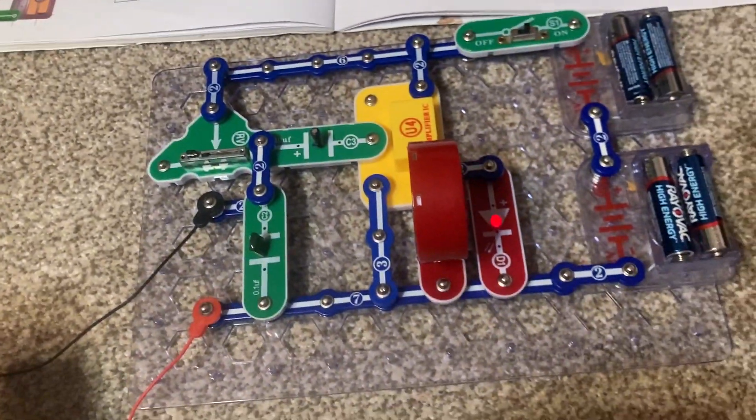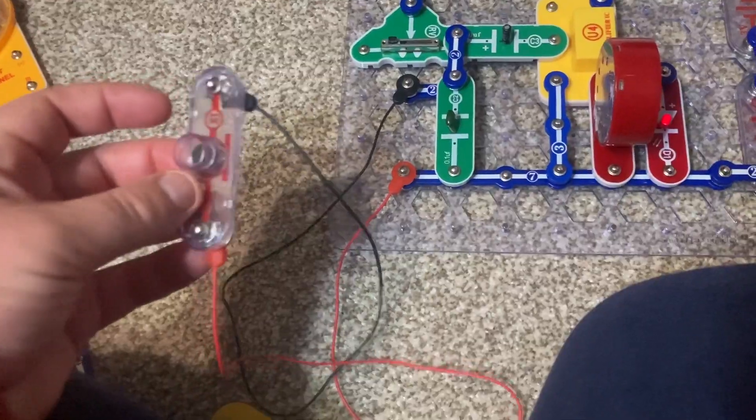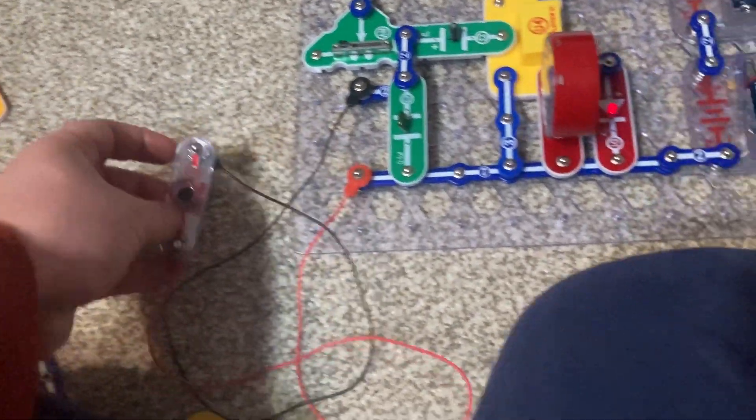With the adjustable resistor set to the far left, I turn on the slide switch and tap the whistle chip — you hear interesting sounds as the red LED comes on. The whistle chip has a piezo crystal between two metal plates; sound causes the plates to vibrate and produce a small voltage, which is amplified by the U4 component. You can place a small object at the center of the whistle chip, and when I remove it, the speaker and LED are activated. I replaced the whistle chip with the microphone and held it away from the speaker — listen carefully to the speaker as I talk into it.